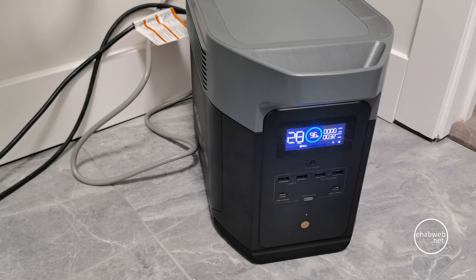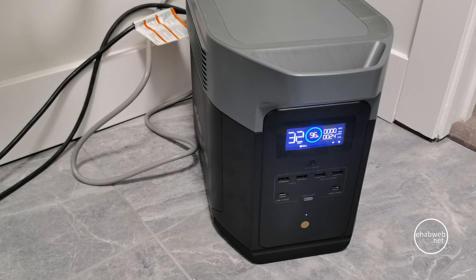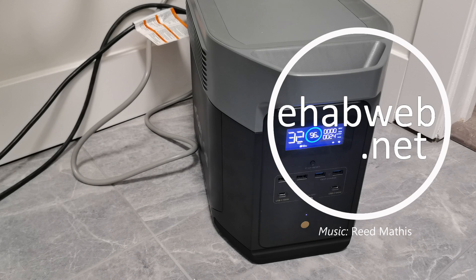You can see that just in standby mode, when the combi boiler is not heating anything, no hot water is running, and nothing is coming out of the sump pump, it's about 30 watts — and it shows here that it could last about 32 hours. So I would estimate it's safe to assume it could last about 24 to 48 hours, or maybe about 24 hours with no power but with heat and everything. I think that's pretty good for a small backup generator.